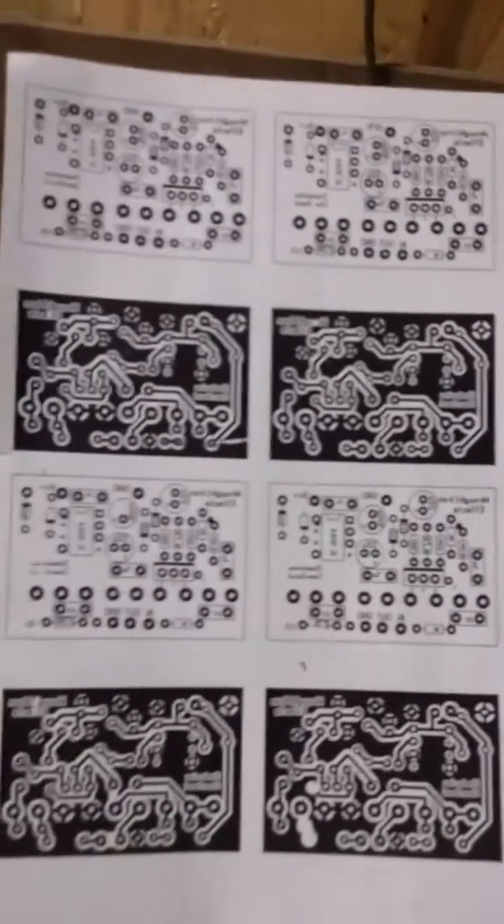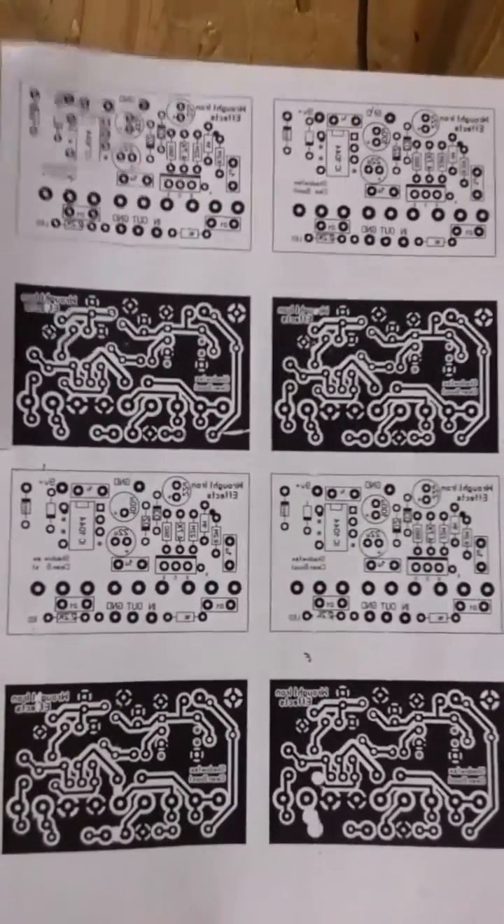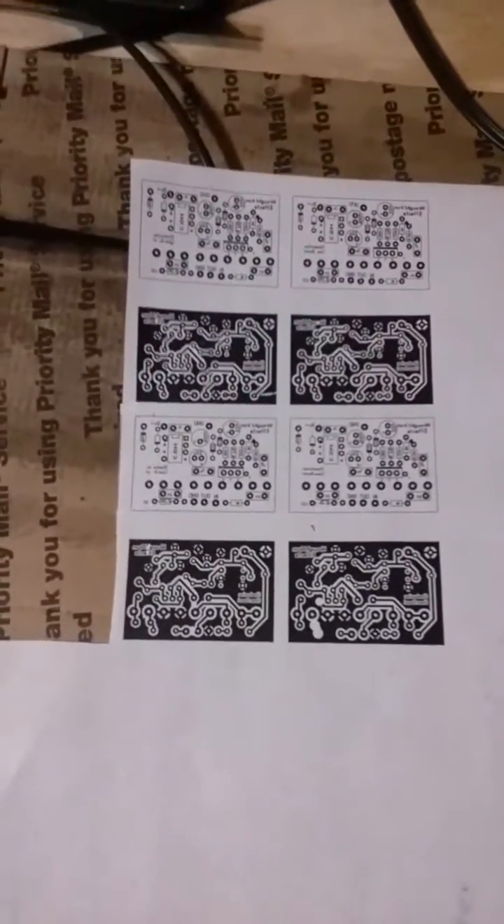You can see these came out pretty good printing-wise. I use the cardstock setting on my printer — an HP right now. I've used a Samsung and that worked well too. Some of the newer laser printers aren't actual lasers; they use LED technology so the toner is different. I got it to print fine but when I went to transfer it, it would not transfer.